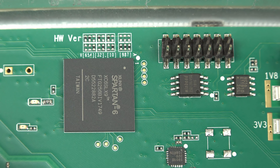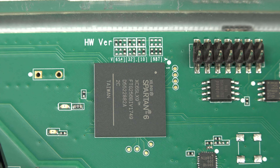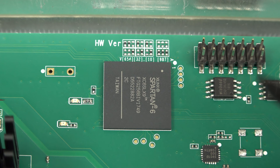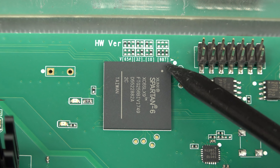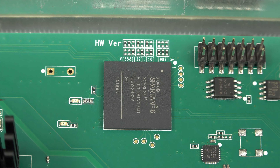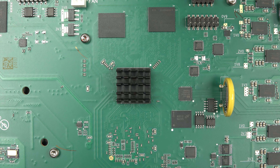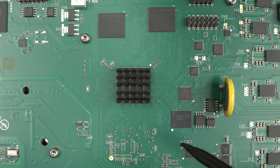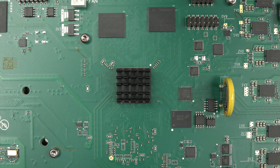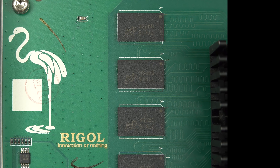And 0.75 volts. Can we make it any more obvious that they're doing some hardware version configuration with this Spartan 6 FPGA? We've got the JTAG there just ready to go. What sort of hardware configuration? I thought everything was software upgradable in this thing. I get the distinct feeling that this labeling here might make sense if we actually get the serial boot output — the debug output.